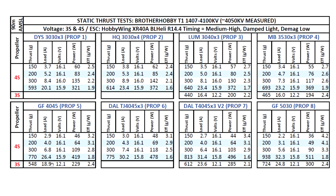On 3S, it's more viable with these larger props. 3S could probably do well on the 4-inch 3-blade and even the 4-inch 2-blade prop. So if you're running 3S, that could be a good match.